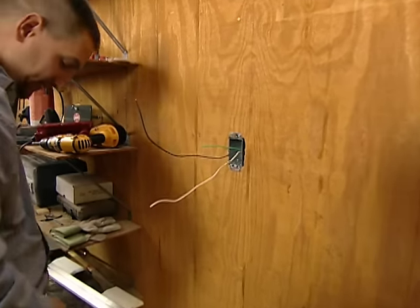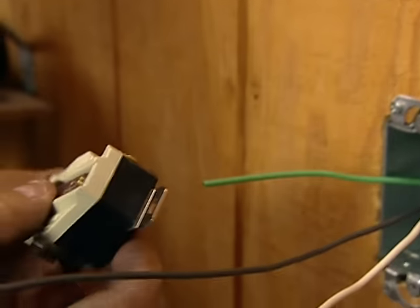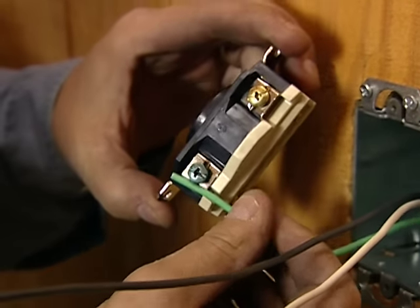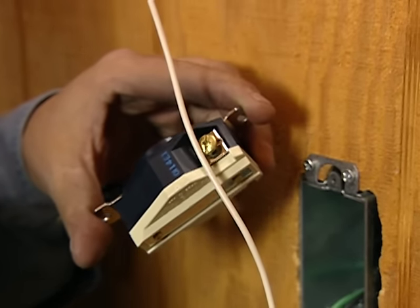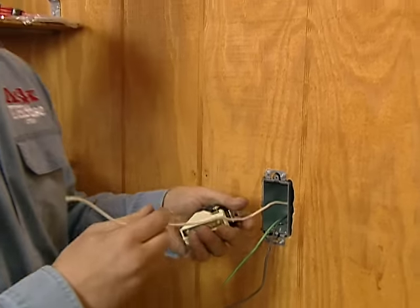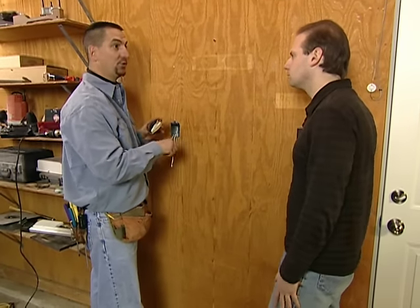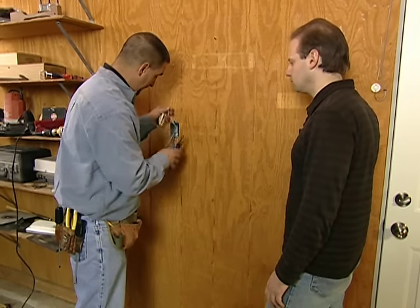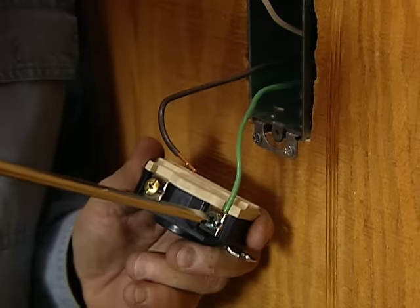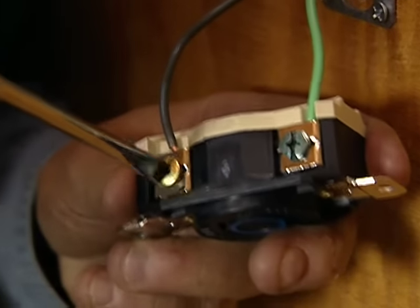Now that we've finished attaching the box to the paneling, I'm going to take this 20-amp, 220-volt receptacle that matches the cord on your bandsaw. I'm going to take the green grounding conductor and attach it to the green screw, take the black hot wire and attach it to the brass screw, then take the white hot wire and attach it to the other brass screw. Wait — white is hot? Isn't it usually neutral? In a 110 application, it's usually the neutral. But here, because it's straight 220, the equipment does not need a neutral conductor, so we're going to identify this wire and use it as a hot wire. I'll strip these wires to the length I need. This receptacle comes with a compression connection — you slide it in and crank it down with the screw. It's a good, tight connection, typical for a 20-amp application.